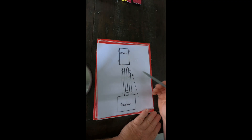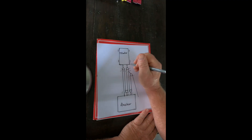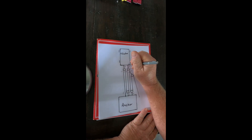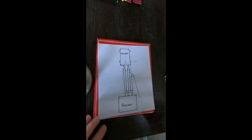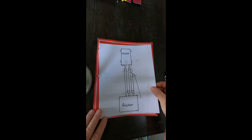Hopefully that makes sense. The input is one T. The final result is six T and six T, and both of those add up to 12 T. One input of T, the final output is 12 T — so this is a 12-to-1. That's exactly what I did with that tractor in my video.